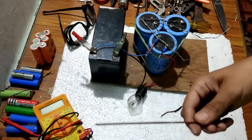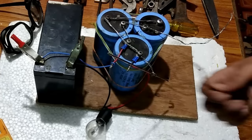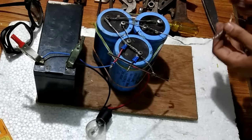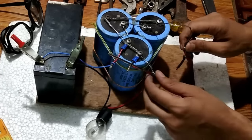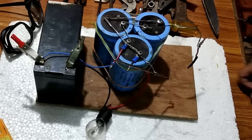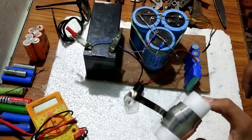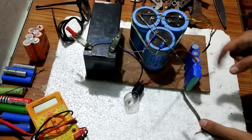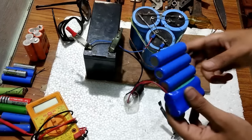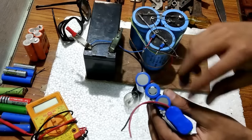Connecting the non-copper electrode first, and now connecting the pure copper electrode. You can touch these two terminals since the voltage is only 12 volts, and it takes more than 48 volts DC to be felt by the human body. This is the nickel strip tape used for connecting 18650 lithium-ion batteries. I am going to use this since I am making a 12 volt DC battery pack. I have silicon-glued the batteries and am going to spot weld a strip here and one here.